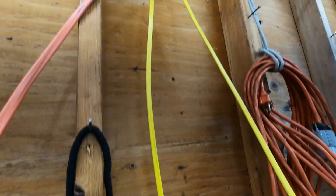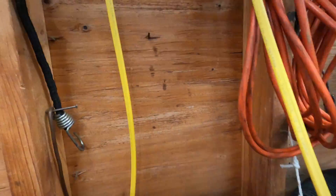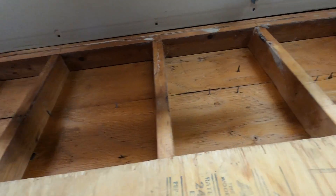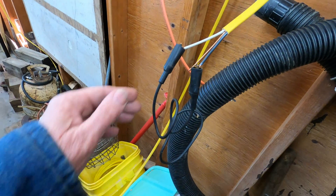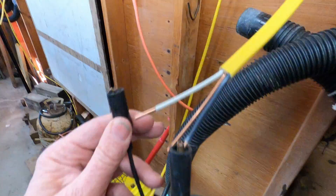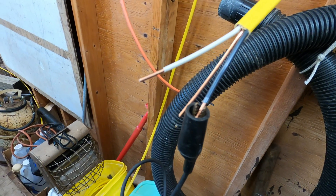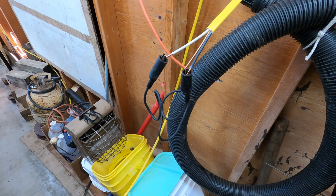In this case, there are two separate cables — one comes from over there and the other goes to the next drop for the next outlet right there. But I didn't mark them as to which is which, so I'm going to ring them out. I stripped the ends of both conductors, white and black, and I'm just going to put a clip lead on it from white to black so those are shorted together.